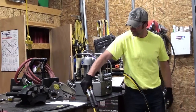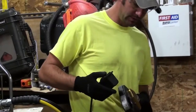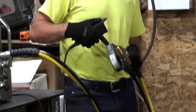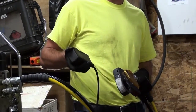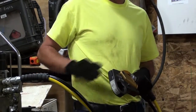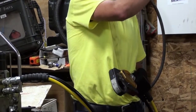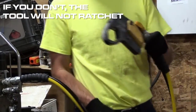First, connecting the tools. You can see I just hit the pressure button and the piston stroked through but it didn't actually turn anything. It's trying to grab the little pin inside there. Once I pressure it up and let it go once, you've got to wait for the piston to engage — there's a piece in there, the actual piston hook, that will grab onto and pull back and push forward. So that first engagement on putting the tool on the hoses is pretty important.